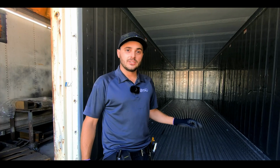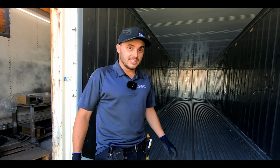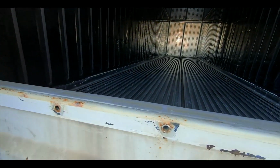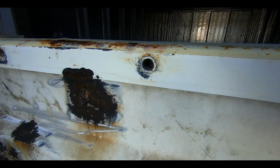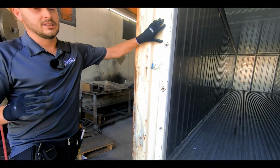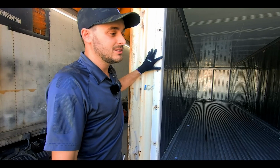These are an electric unit. They're 460 volt, 3-phase. They are much easier to remove. There's just the stainless steel bolts all along the perimeter. You hook a chain up to the top of it, lift, and it is removed. So yeah, it's a much larger hole as well than what the diesel unit leaves.